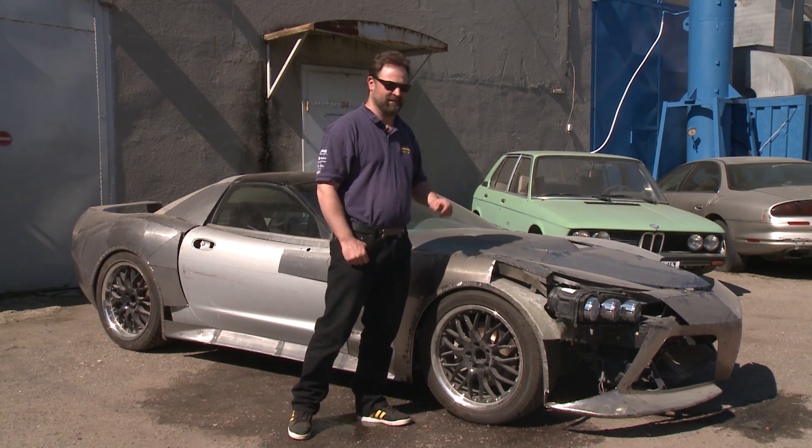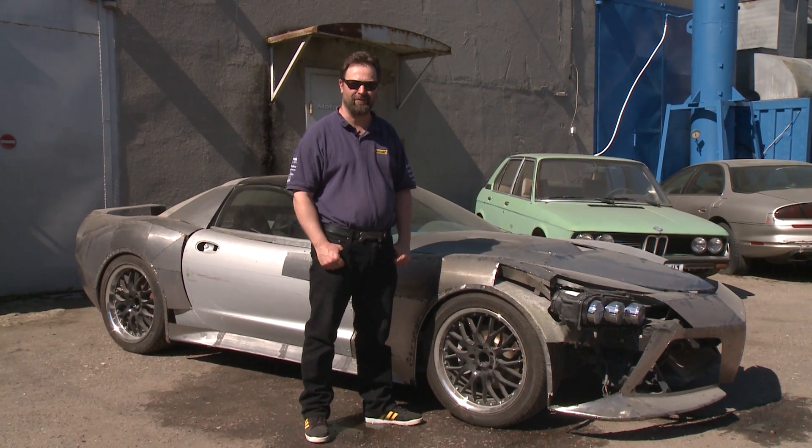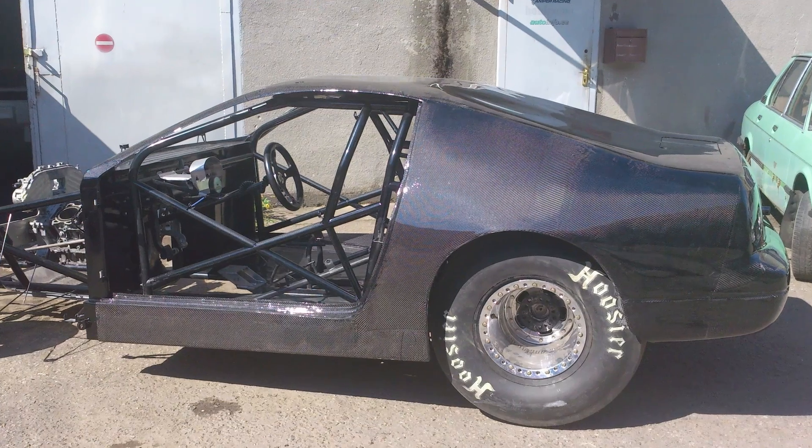Of course it's difficult to manufacture something like this into mid-air, but difficulty is something that actually teaches us a lot. I've done some sheet metal work, but not something this big. And one more good thing about sheet metal is that duplicating the other side — mirroring it — is a lot easier than with glass fiber or other stuff. It won't stay metal though. We will make the body, then take glass fiber molds from it — all the fenders and everything — and then make it from carbon fiber, so it will be really light, really strong, and really modern.